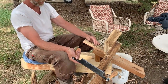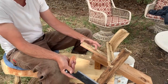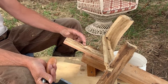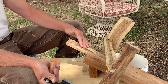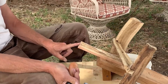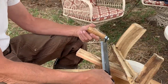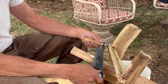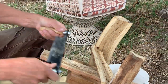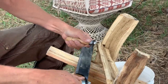The first thing I'm going to do is pull down an area about like what's extending past the bench surface here, and then I'll be able to use that to hold the piece and work larger sections of it. Basically I'm just trying to get this end down to a three-quarter inch square. With the bevel side up on the draw knife, take light strokes — don't try to take off too much material at once — and peel this down.